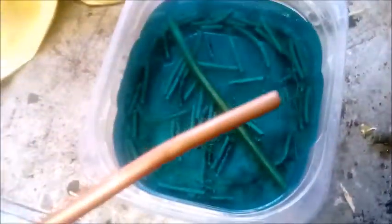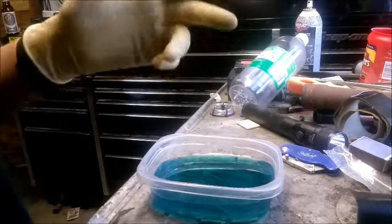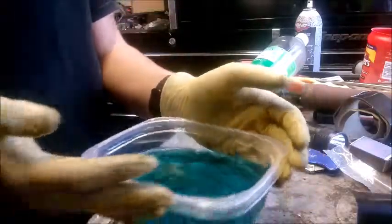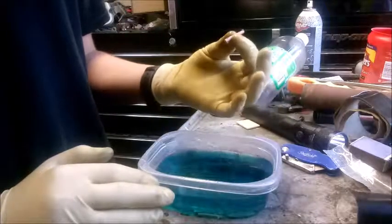I just have a little piece of tubing as my positive electrode. It's in the solution right now, just letting the outer layer dissolve — letting the oxidization dissolve a little bit — and then it'll be ready in a couple hours. It's been about 12 hours since I started. The copper is dissolving nicely. It's a very nice blue Gatorade color — I wouldn't drink it, but it looks nice. The oxide on the outside of most of these big pieces is falling off and the copper is dissolving.